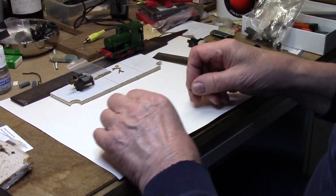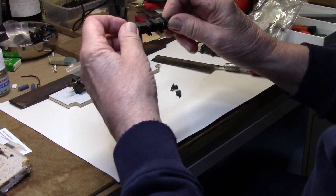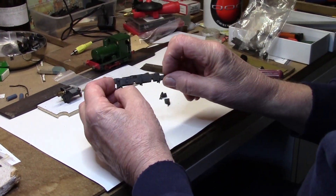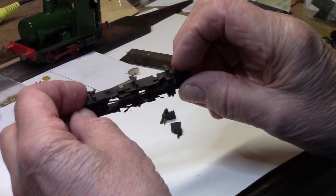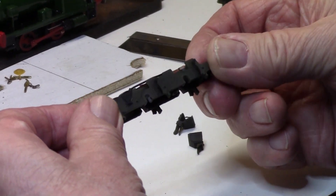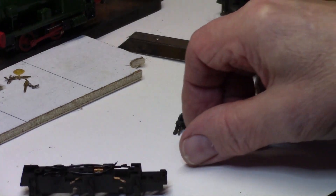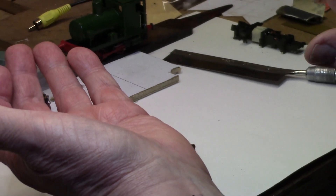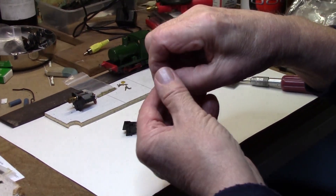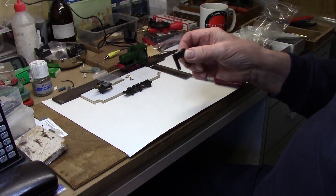After that you end up with the sand boxes cut off. As you can see, it's come off quite nicely with a minimum amount of rubbing down, but if you need to, just file it down so it's flat — you want that surface to be flat. You've got two sand boxes; they can go in the bit spots for a loco that needs them.